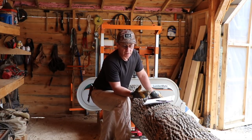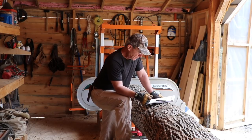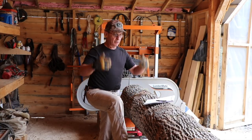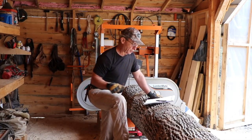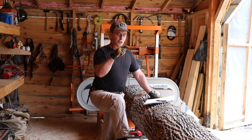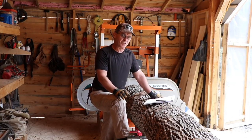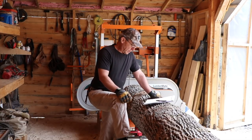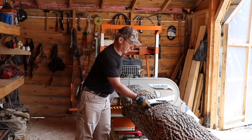I prefer the look of the lap siding but I'm not against board and batten. Somebody said to use board and batten with a Tyvek backing or some sort of screen backing to prevent leaking, which was a good idea. I could still do that with the lap siding. One guy said he did his lap siding with number eight screw type nails on the top and 16s on the bottom. Since I'm using one inch lumber, I think I'm going to screw mine. Somebody commented that it would be a lot less work, and I agree.